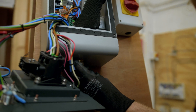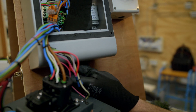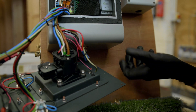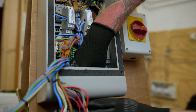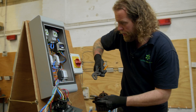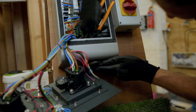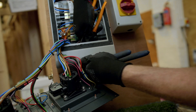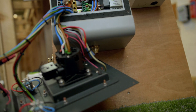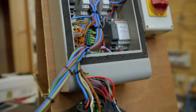Just a locking nut into there. Then we get a pair of grips on that and do it up nice and tight. Get a pair of grips in there and do that nut up nice and tight. So that is in there. We are now left with the rest of the SWA gland, and we need to make it off into this unit.